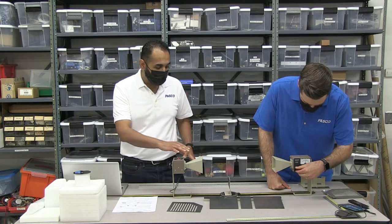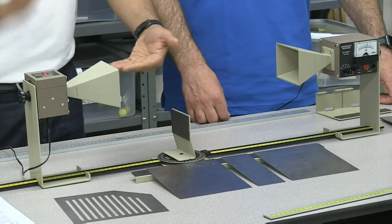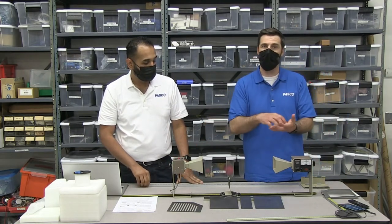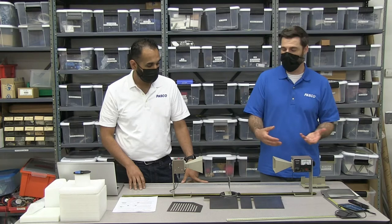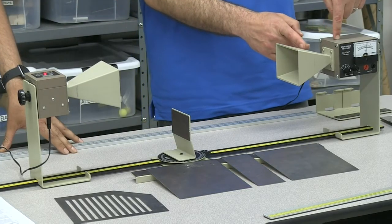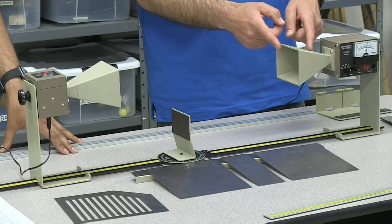What's important is the wave — there's a slit in here, the slit is oriented like this, but the wave is actually traveling up and down. Inside each of these is a resonator, a resonant cavity that the diode sits in. These horns are just waveguides for those microwaves. We point them at each other and one sends, one receives. The diode is sitting back in here, and because of the geometry, the waveguide, and the resonant cavity, the effective point at which it's being received is about five centimeters from the front of the horn.